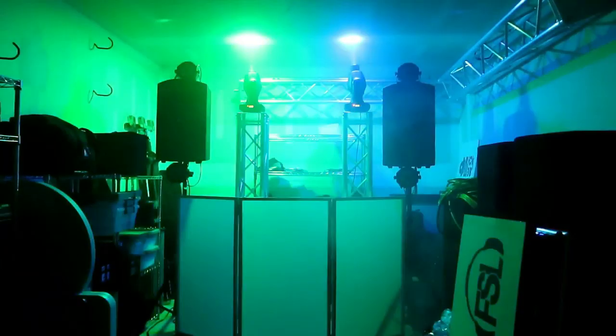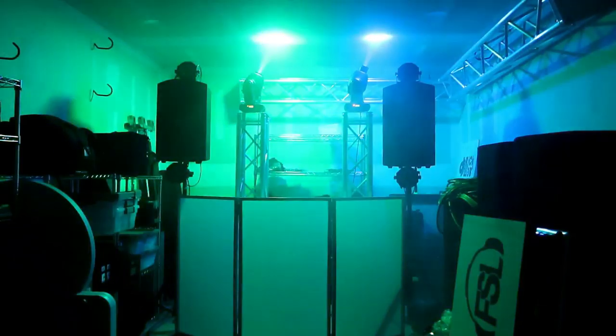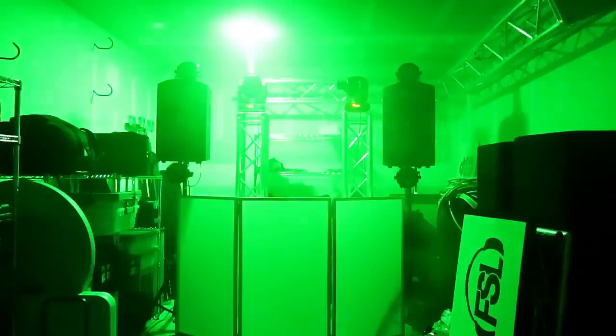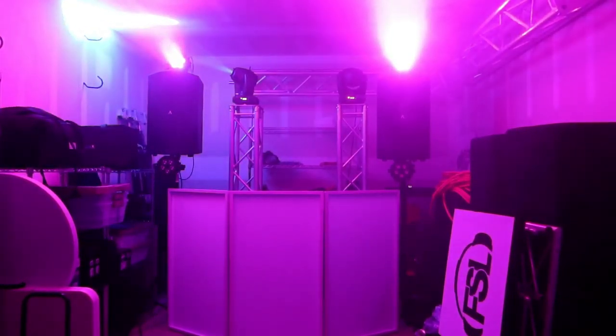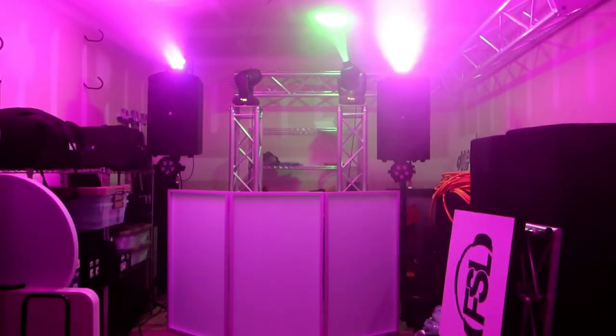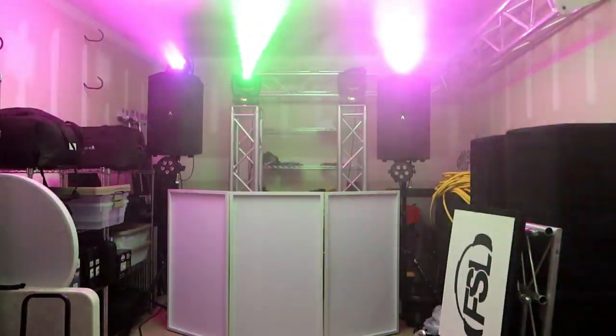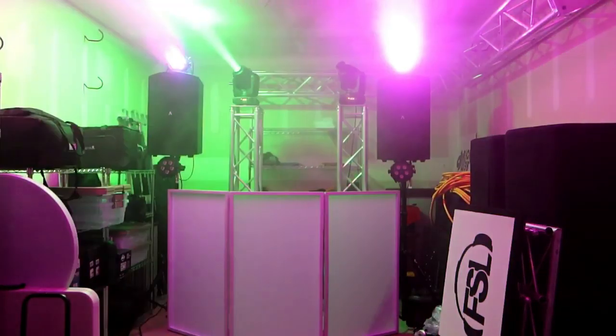I just added a tri-prism which splits the beam into three different beams, making it a wider spot and a cooler beam effect. The haze has been running for less than a minute and this is what spot movers look like in haze - it is a night and day difference. That is why it is a million times better if you use haze or fog when using spot movers. With beam fixtures, without haze they look absolutely bad, so don't even use beams unless you have haze. You can also see the effect of layering indirect wash lighting from the pars above with the movers themselves.